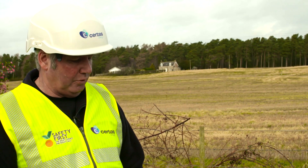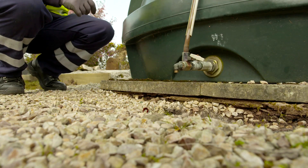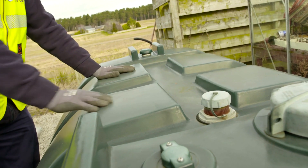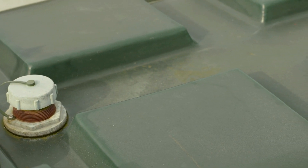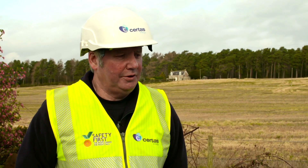Bleaching and rusting the tank — one of the most important places to check for rusting is where your outlet is, down towards the bottom of the tank down here. We're also looking for bleached areas around the tank where sunlight might have bleached it. As you can see in this tank here, there are certain areas which have been bleached by the sun. So we'll give Elizabeth's tank the TLC check and it looks like she needs a new one.